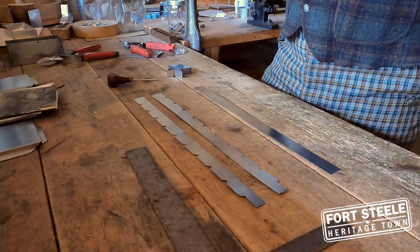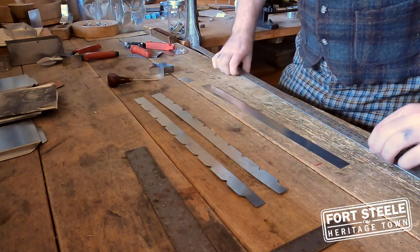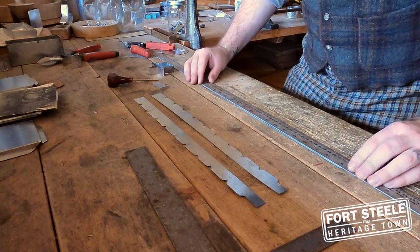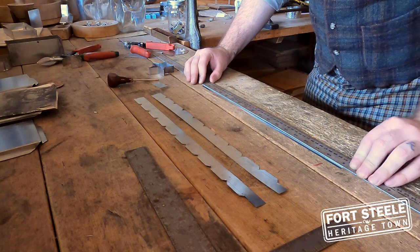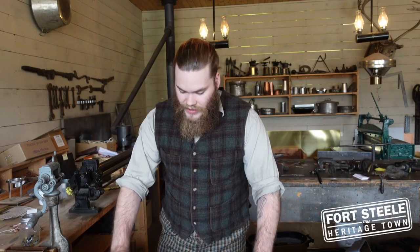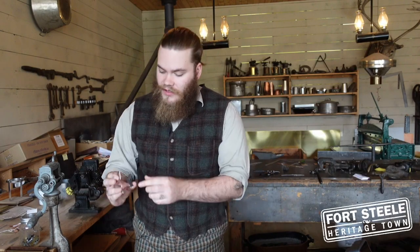Now I'm going to take a long ruler or a measuring device of some kind and I'm going to set it up over my piece of tin with about a quarter inch of material exposed over the top of my tin. It could be a little bit larger, like five-sixteenths — somewhere in the middle, wherever you feel comfortable. This is going to be these little lumps on top of our segments that get folded over in the final cookie cutter, so you're not pressing on sharp edges.